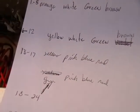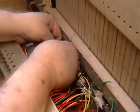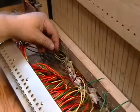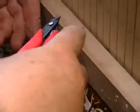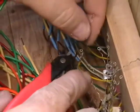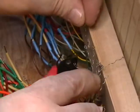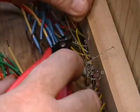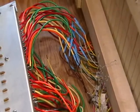So the unit is going to be spliced back into the assembly. And one of the things we're going to do is unwrap number 8, and then trim the leads. Now this is the wire wrap, and it's all oxidized and it won't solder, so we're going to cut them down to here. And you'll find that the green is going to be shortest because of where it is in the harness. And the green will be the shortest wire.